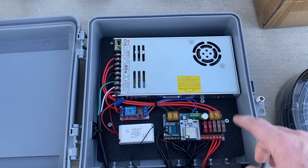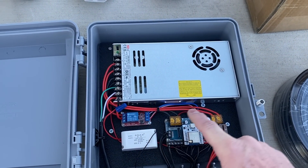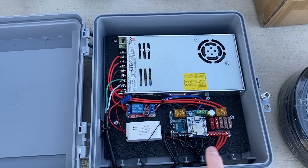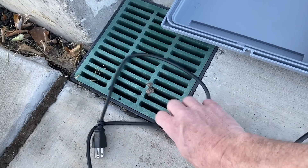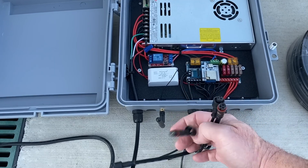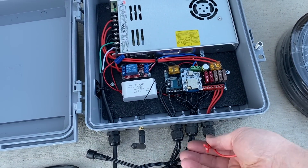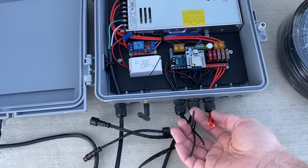This is the control box — it's new. It's got the power supply, the DIG quad, a five-volt power supply, and a relay so you can turn off the big power supply and have it last a lot longer without using power, but still be able to communicate with the DIG quad. It's all integrated, pre-wired, all in a big waterproof box. It's got connections coming out — one is just the power so all you have to do is plug it into the wall. It's got four mini X-connect pigtails that plug into the pixel strips, plus red and black for power injection if needed.